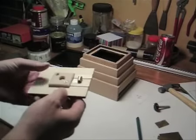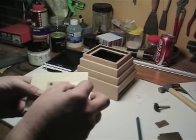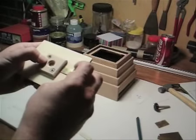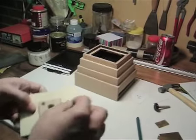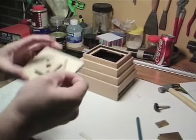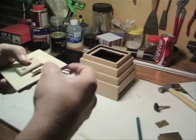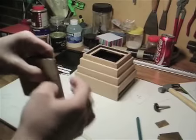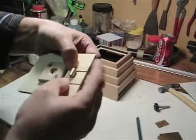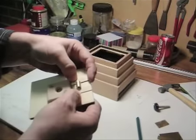I just wanted to show you this. I've decided to make up two guides for the shutter slide here, because the guide is just a little bit too sloppy for my liking. So I've made up a very thin three-ply — you can buy this in hobby shops, usually used for making model planes and that sort of thing. You only want something thin here, though you can use a thicker three-ply if you like. I'm going to glue those in parallel along the guide, and there'll be a nice little secure glide for the shutter slide.